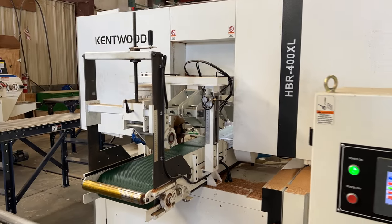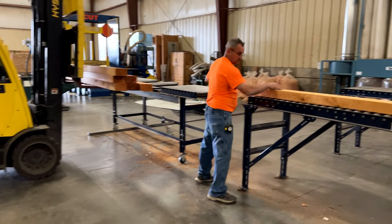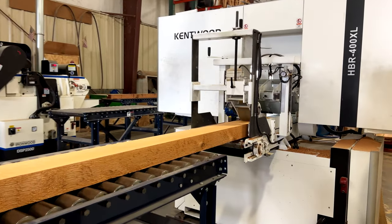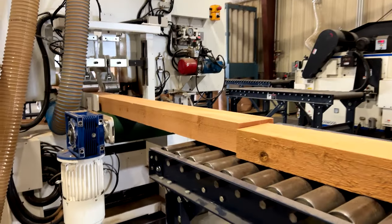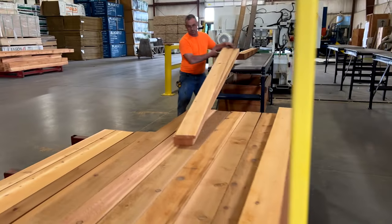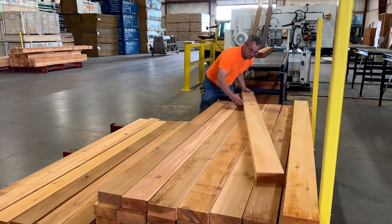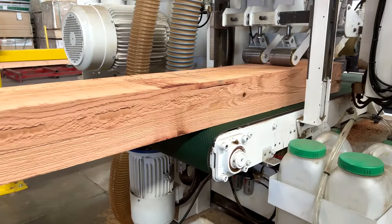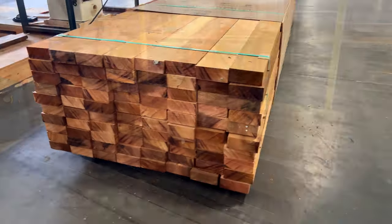The whole process starts with state-of-the-art equipment and a professional, well-trained sawyer. We use a state-of-the-art Kentwood resaw that allows us to cut up to a 12 inch by 16 inch timber. Using precise input measurements, we are able to cut to within 1/16 of an inch. All cuts leave a clean, even textured bandsaw rip. We get excellent throughput on our resaw, allowing us to run a job for just one timber or a hundred. We can run a variety of products and species including cedar, Douglas fir, pressure-treated, fire-treated, Parallam, and TimberStrand, to name a few.